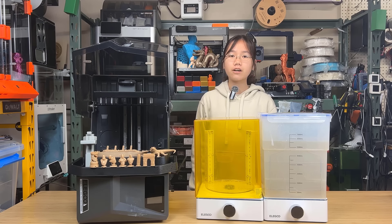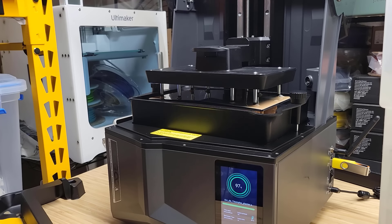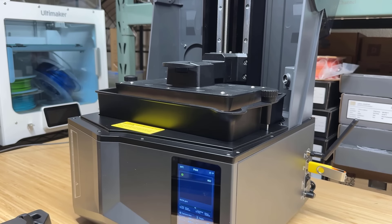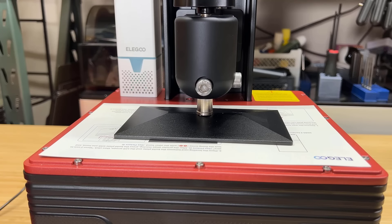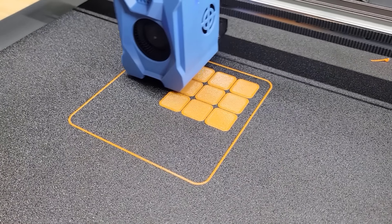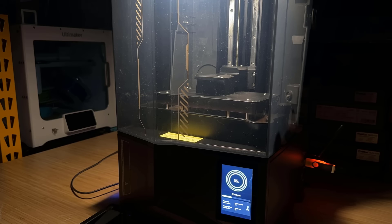Let's talk about the pros and cons of this machine, starting with the pros. First, the best feature is the movable resin tray. It can effectively release the print and even print multiple objects at once without a single failed print. The print speed is also faster, as the time wasted in resin printing is lifting up the Z-axis to release the print and move back down — using the resin tray for release is much faster, even though the curing time of the layer is the same. Second, auto-leveling — it just prints right out of the box and it works. The most confusing part for resin printing beginners is leveling the platform with a card or paper, because as you adjust one side, the other side just feels too loose or too tight. For FDM printing you'll see your print isn't sticking well by the first layer, but for resin printing you may not realize it until it's been printing for an hour and you finally see nothing is on the platform. This auto-leveling sets the distance between the platform and the film of the resin tray, which also contributed to the high successful printing rate of this machine.